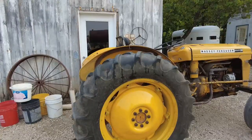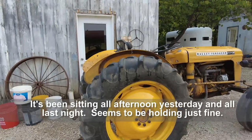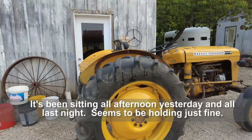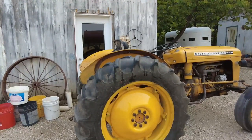I took a short video this morning of the status of the tire on the Massey Ferguson 35, so take a look at this. Here's the tire in its final form. It turned out it was an airlock problem, I think. There was possibly some kind of a clog in the line, but I'm assuming it was an airlock thing, because every time I would blow through it with the air hose, it would drain very quickly after that. It turns out there probably just was an airlock going on in that.